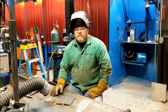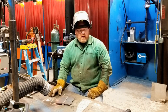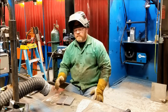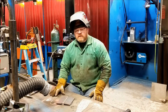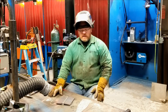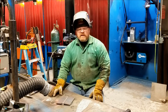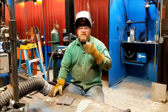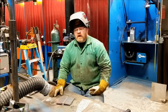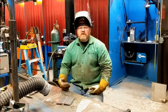Another example of pre-stress and pre-camber: the stainless steel plates we just welded were pre-stressed — they were bent. This is a technique that definitely involves some guesswork, and it's a tool to have in the toolbox. I've seen examples of pre-stress and pre-camber that worked phenomenally well. But since you are guessing how much to pre-bend the part, it takes some experimentation, and this is not a process that is likely to produce perfection on the first trial.